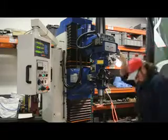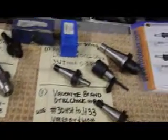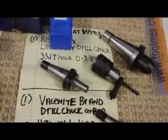What a smooth mill head. It's a five horsepower with the number 30 NST. Now you'll note on these number 30 NST holders, it's just a little bit smaller than a number 40 NST. We have a great selection of drill chuck arbors, standard end mill holders, number 30 NST collet chucks. The tooling is readily available. Here's the Bison catalog — the little buffalo in the circle — the European brand, as well as the superior high quality import as well.